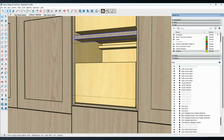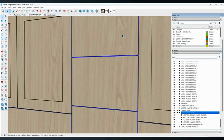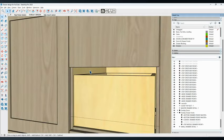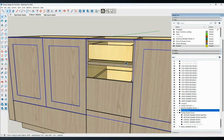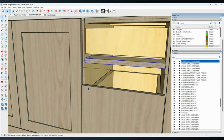What you want to be looking at — the key to this — is you make all the adjustments, everything looks good, great. But if you have something where this drawer front is still big and you look in and see there's nothing there, no stretcher, you're going to have problems. So that's the stuff you've got to watch out for. It is fairly simple if you know you want that 1/8 inch gap and you use the center line on the stretcher as a reference. The drawers on the sides are standalones, so they're a little simpler.